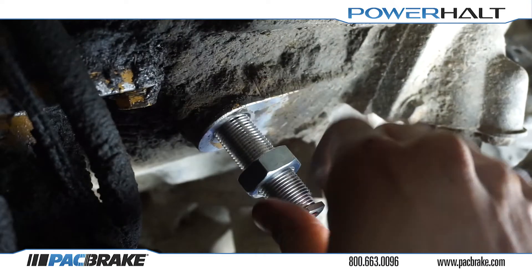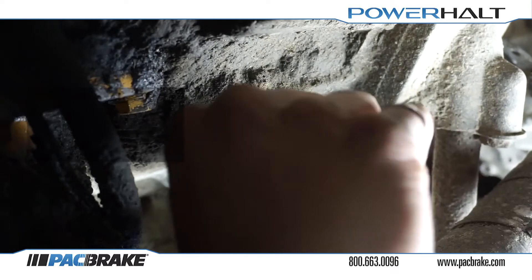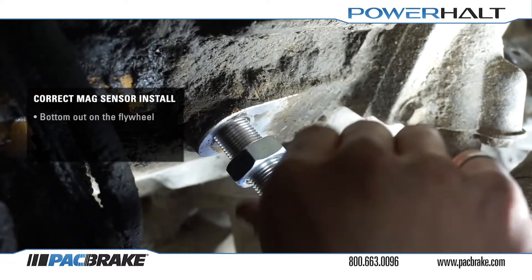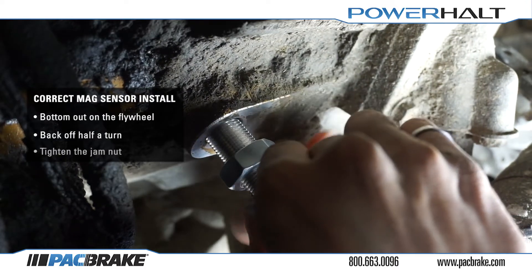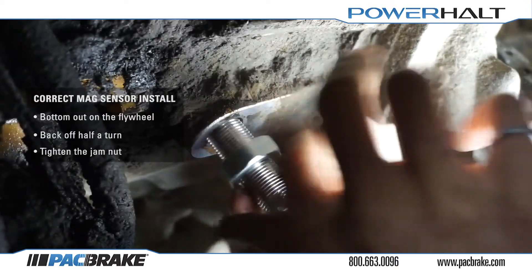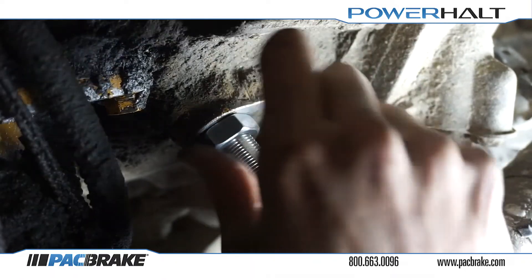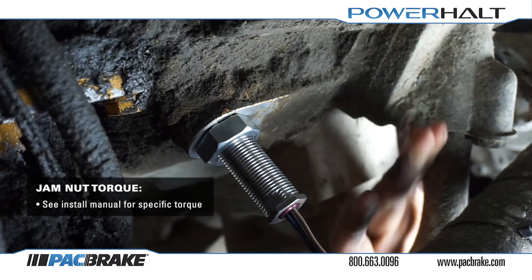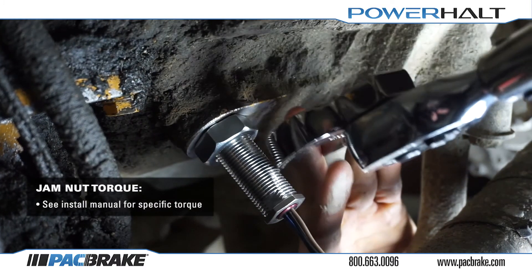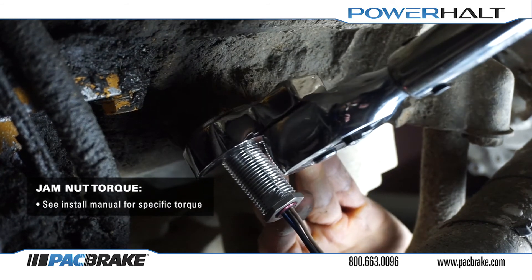Having confirmed that the sensor is correctly centered to the flywheel teeth, we can move on to confirm that it is installed correctly. The sensor must bottom out completely on the flywheel before it is backed off a half turn before tightening the jam nut. Oftentimes, a burr or dirt buildup in the threads will stop the sensor from threading all the way in. Use calipers to measure and confirm the depth if necessary. The threads can be cleaned out with an appropriately sized bottoming tap if you are finding there is an obstruction.